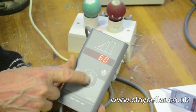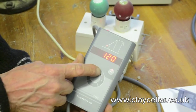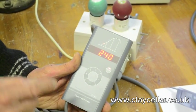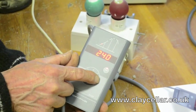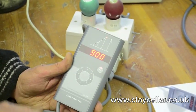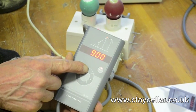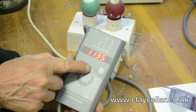So there are probably four speeds to remember: 30 and 60 for biscuit firing, 120 or 240 for glaze firing. Don't forget the intermediate temperature of 600°C is already fixed in the controller. From that point on, the controller goes at full power to your top temperature — you have no option on the second ramp. The top temperature can be changed in five-degree increments; just keep your finger on the button and it'll scroll up to whatever you want.